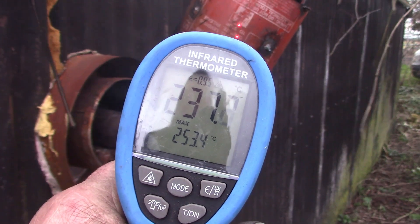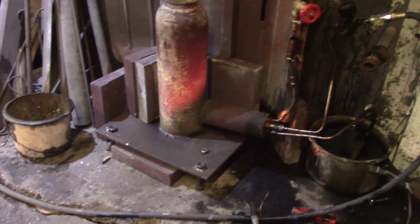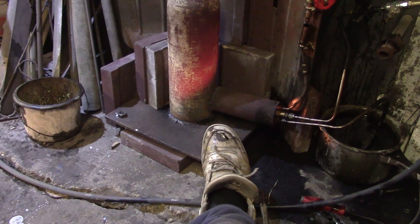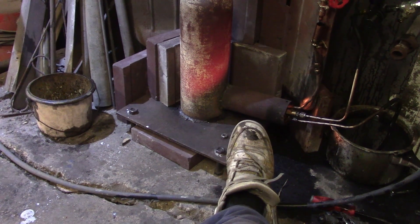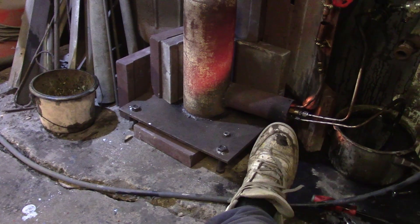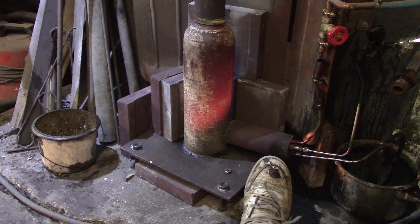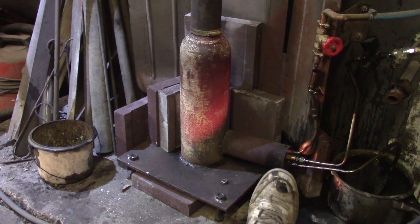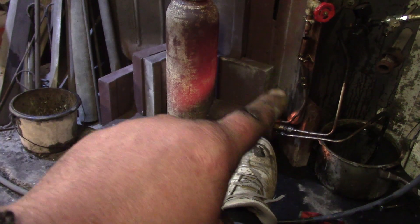I think we're doing a reasonable job of recovering a decent amount of heat here. Obviously this is a very short exhaust. Expect some more shenanigans with the siphon burner — I don't think it's perhaps the best thing to be using for a free-draft burner. I think it will only realise its true potential with a blower behind it. I'm going to mess around a bit and try to maybe replace what I've got in my foundry with it when I do the ceramic insulation upgrade.